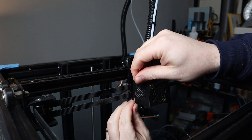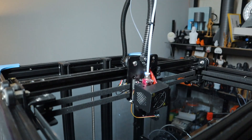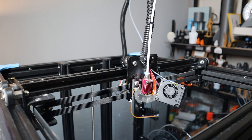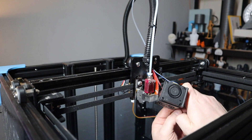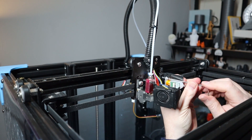Now we start with the part where you remove the screws — three screws with the standard hardware that comes with the Ender 6. I use the Allen key to remove the fan shroud. On the backside or inner side of the fan shroud there are two holes where you can install the BL-Touch. Make sure when installing the BL-Touch there that the included hardware may not fit, so I used two M3x8 Allen screws. If you got your kit from Creality, the needed screws and fasteners should be in there as well. Make sure the connector is on the inner side, and install the extended BL-Touch wire.